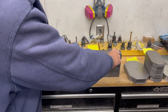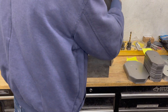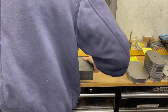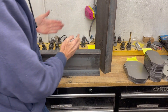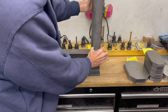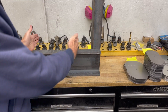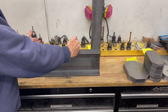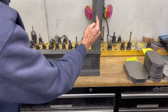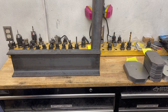I went with 14 inches wide. The opening is going to be about 30 inches on the upper section. There's going to be two of the C-channels, one on either side. I'm going to lose about two inches on either side. With what I'm doing, everything going in here is like 12 to 14 inches, so it should be plenty big enough. The actual span from where it's connecting on either side is actually really small, so I'm assuming this is going to be plenty strong enough.